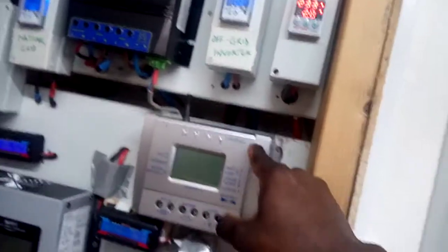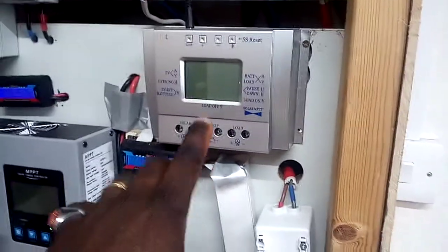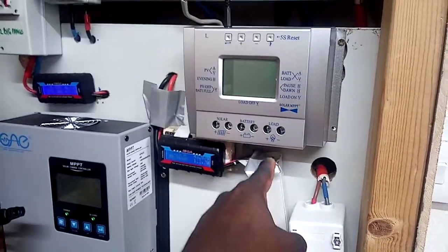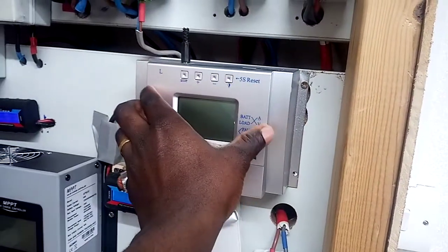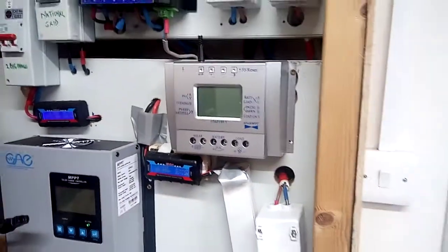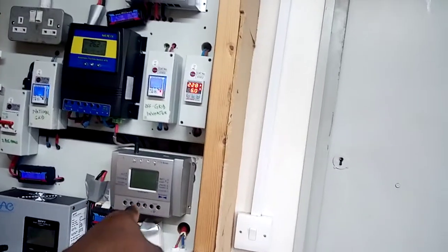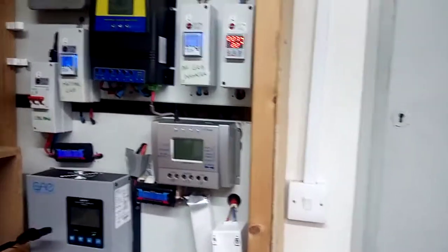I noticed they sold me a dodgy unit with this one. I have two of this type — another one is in my country and it behaves the same way. I used to have four panels on this one, so I removed one and added it to the working unit. This L80 one I've never had any issues with, but the other one, once it goes above 30-35 amps it just stops — you'd get zero amps coming through. So that's my review of this type of charge controller — it does work as MPPT, I've just had issues with this one unit not going above 35 amps. Thanks for watching, cheers.